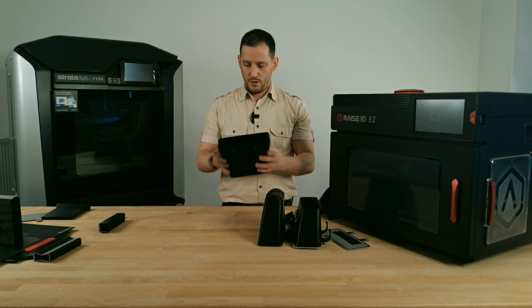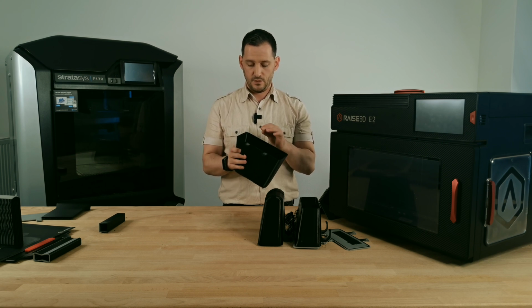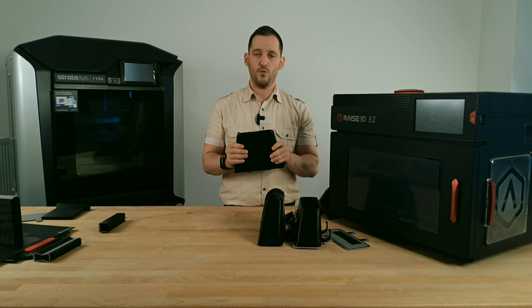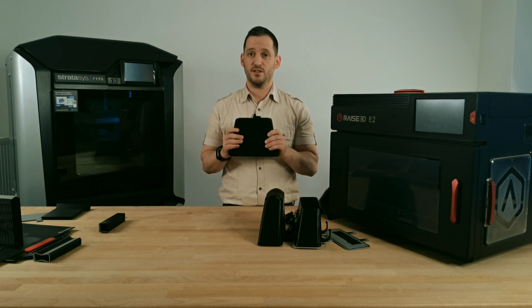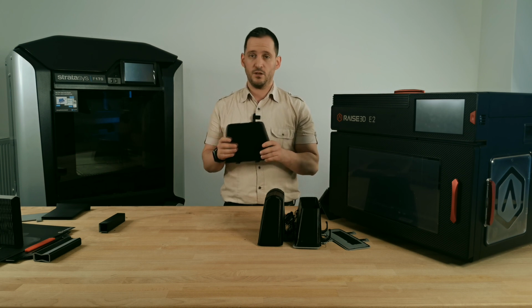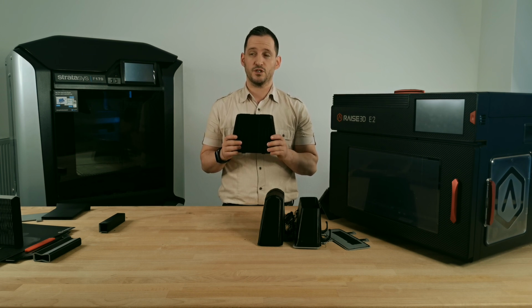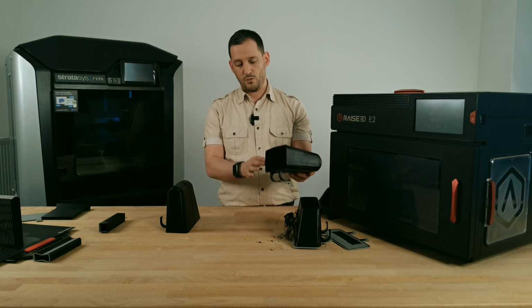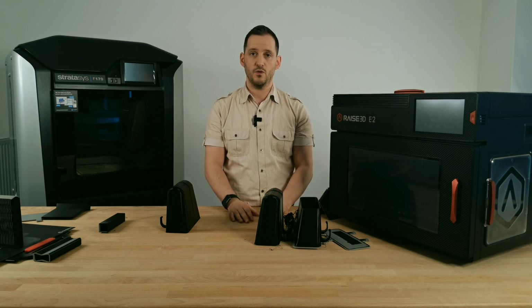Yes. So the Stratasys printer does have a better accuracy. It prints big parts from ABS, thin walls, high parts without any problems because of the heated oven we have in there. So for a $20,000 printer, yes, Stratasys can print ABS, and it can print it really, really well. So if you want to have repeatable part accuracy with ABS prints, you should go for a printer which just has a heated oven. Without that, most likely you will come up with parts like this, where the corners just lift off, and you may have difficulties getting the parts right over and over again.